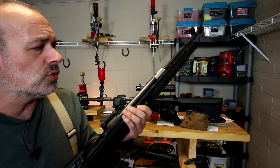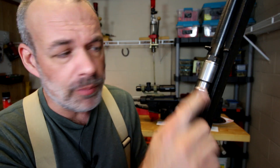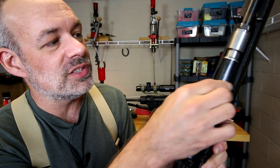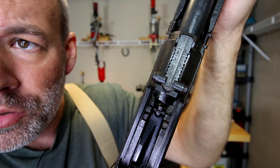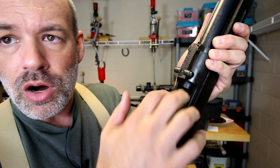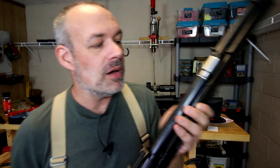If you're not familiar with the VZ-52 rifle — I've already taken the handguard off for your viewing pleasure. Basically there is a gas port drilled into the barrel up here, and it hits a collar that forces back this piston, which in turn forces this sheet metal operating rod. It goes around about half to three-fourths of the barrel and moves the operating rod all the way down. You can see those two operating rods coming on either side of the chamber — they come out about a half inch and shoot the bolt all the way back to chamber the next round. How Glock can patent that while it's been in the public domain for decades, I have no idea.